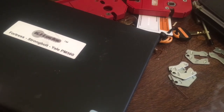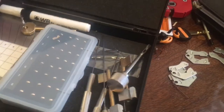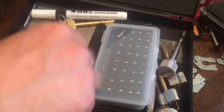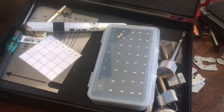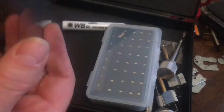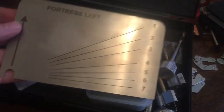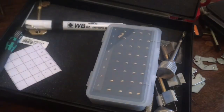I had the old decoder which used printout charts and a different makeup key, so I'll show you what comes inside the kit. First thing - it's different. We have metal reader charts, left and right depending on which way the lock is mounted, and also one for the Strongbolt and Yale left and right. The Strongbolt and Yale have 8 lever heights, but Fortress only has 7 - that's the first difference.